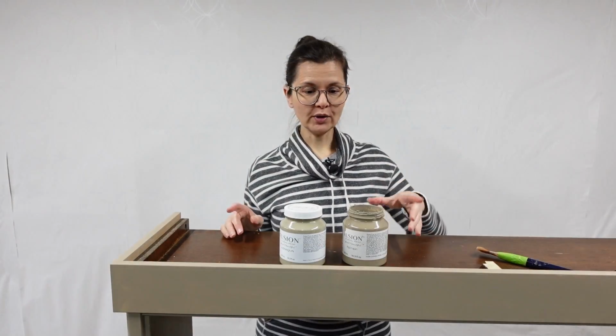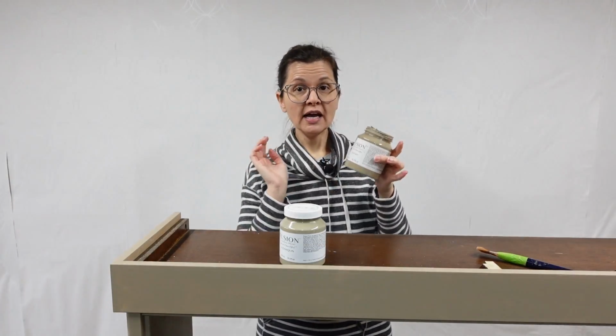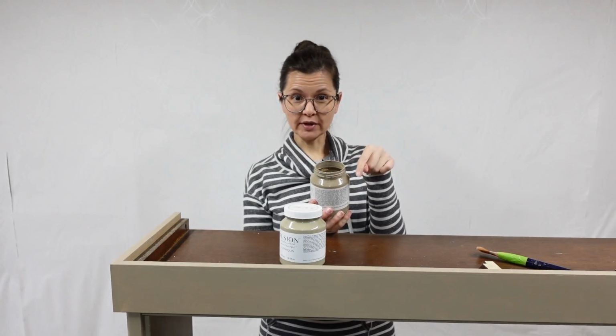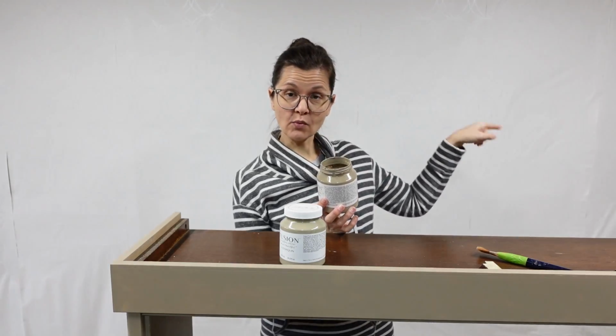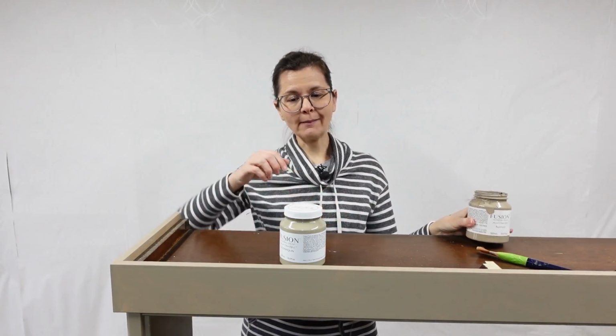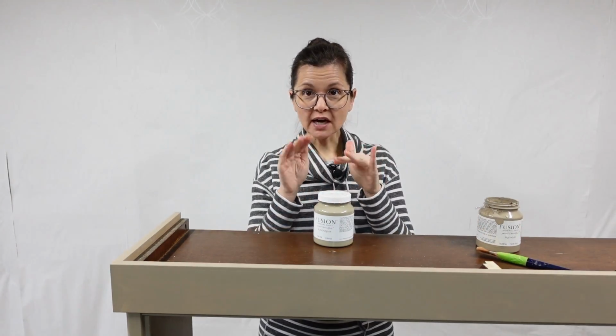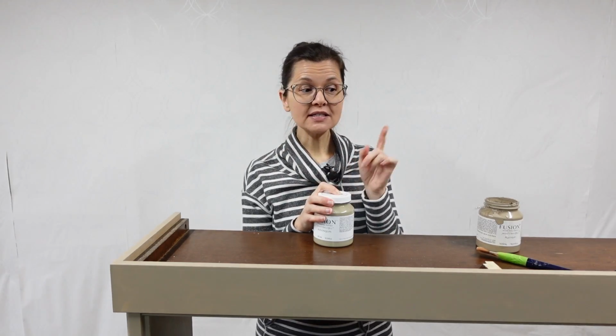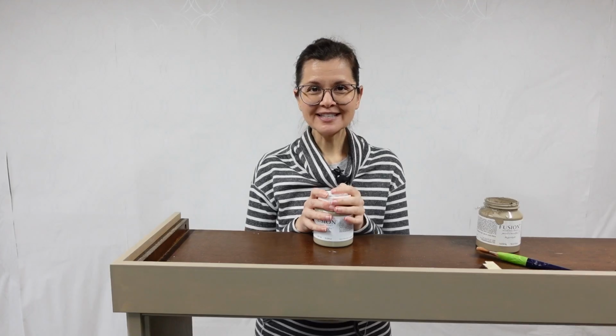Everything's pretty much had one coat of paint, and I've run out of my Fusion jar. Now, I've used this one jar to do a little bit of work on the table that I use down here and to paint the armoire that sits over there. So one little jar of it does go pretty far. Well, I did get myself another one, and Fusion's paint time in between coats is 4 hours, and it's been 4.5 hours since I started the drawers. So time for second coat.